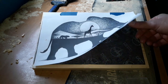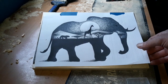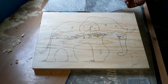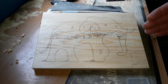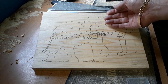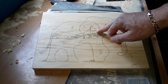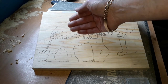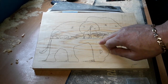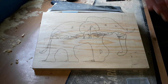This will be on five levels — I'll explain as we go along. We've got our image on there. The way I do it is simply carbon paper underneath and draw around it. It's the easiest way. Now you can see here I've looked at it and I'm working from the depth from the furthest back, which will be the sky — we mark this as number five. Then we lift the router up slightly, do number four, lift it up again, do three, lift it up again, do two, lift it up again, and then do one — and that will be the finished edge. So it drops down one, two, three, four, five, and this gives us a little bit more depth.